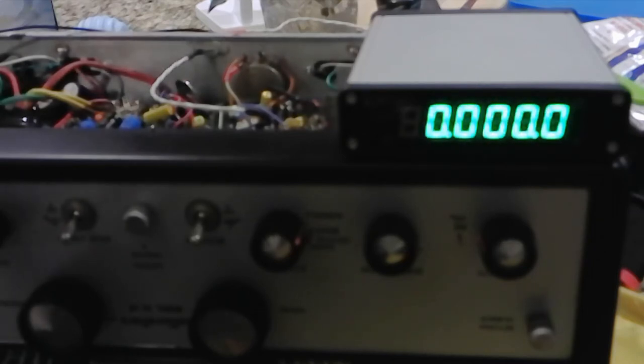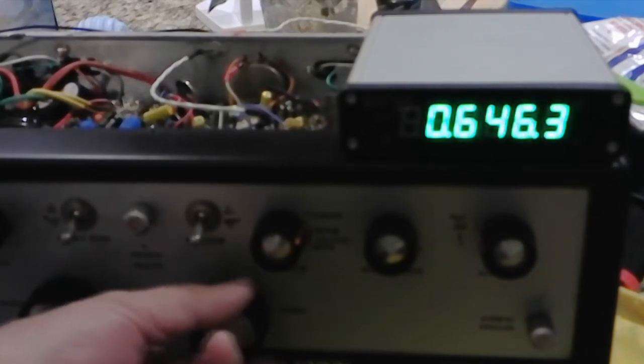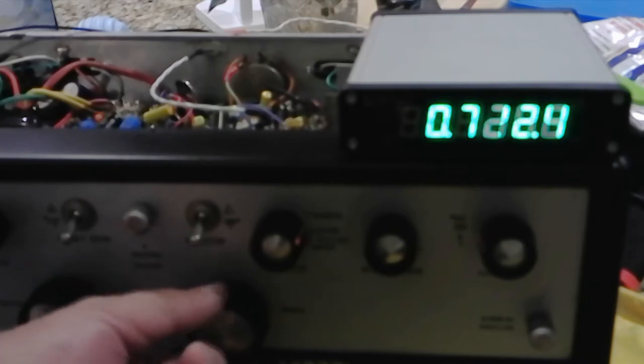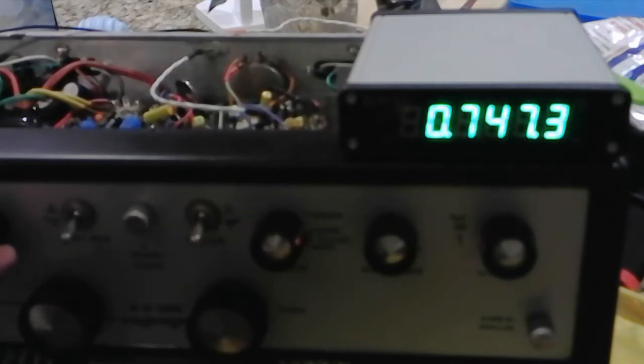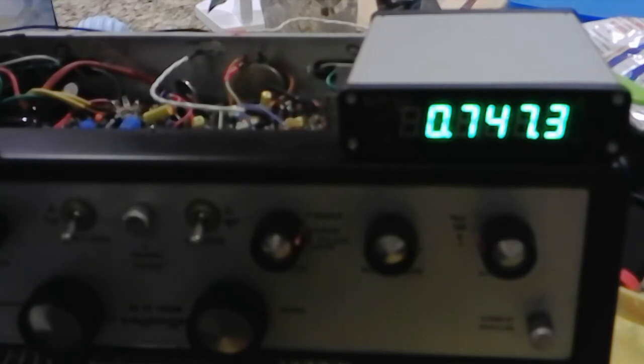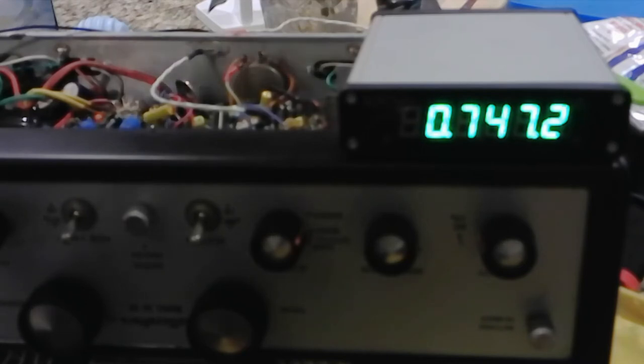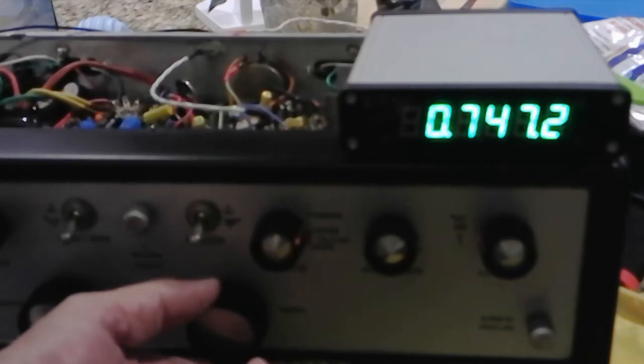Look at that. And it was as simple as a 47 picofarad capacitor. It's the only pickup needed. There we are. I had a little hum with no signal, just a no-volume hum. There was a 15 megohm resistor over here in the audio output that had been pushed down and was shorting against a capacitor. So it was pretty easy to find.